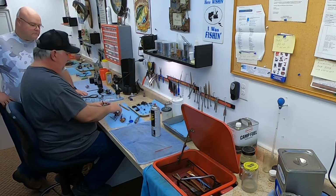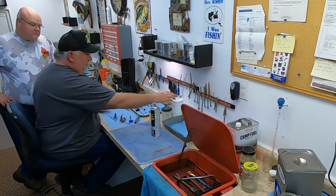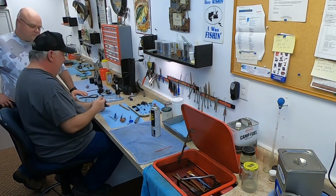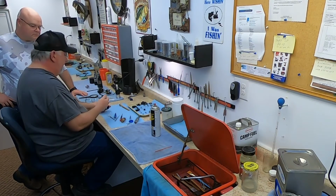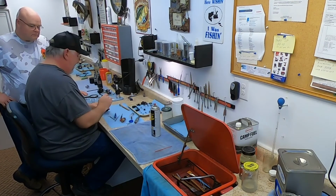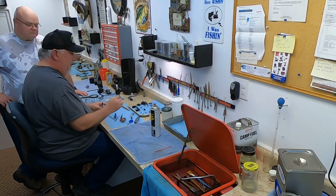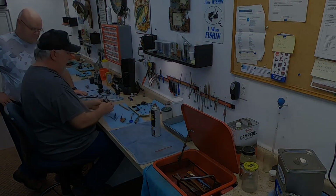If any of this was dirty, wipe the dirty grease up. And I put a little grease in a little cheap syringe like that, and literally I can just force a little of it under some areas like that. A little brush it down in there, and for most basic maintenance, we'd be ready to go back together.